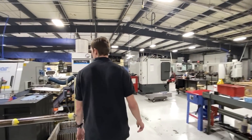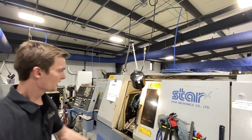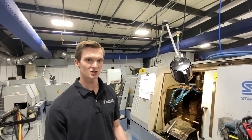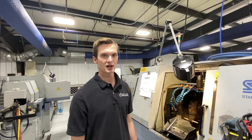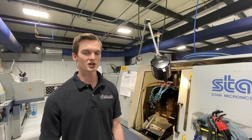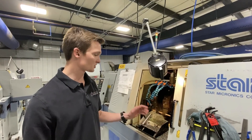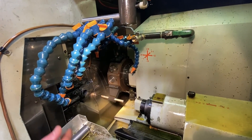We'll go over to the 32 millimeters. These are our Star SV32s — we love Star, it's fantastic. The SV32 is a really capable machine. Inch and a quarter diameter stock is about the max you can run in it, so it falls in a really good niche. We run high volume parts on this — lots of complicated jobs for the fittings industries, industrial industry. We've made hydraulic fittings and parts that have gone all over the world on these machines. The machine has a sub spindle, guide bushing, and main spindle on the other side of the wall.